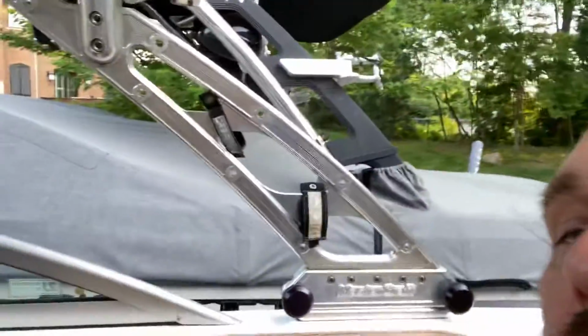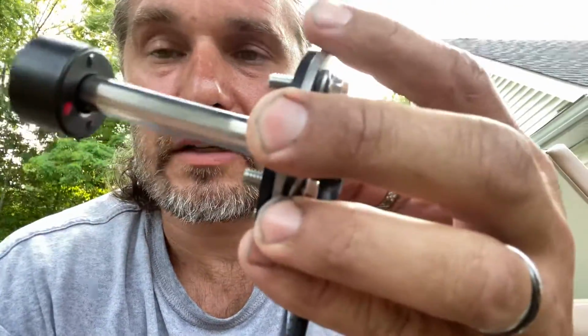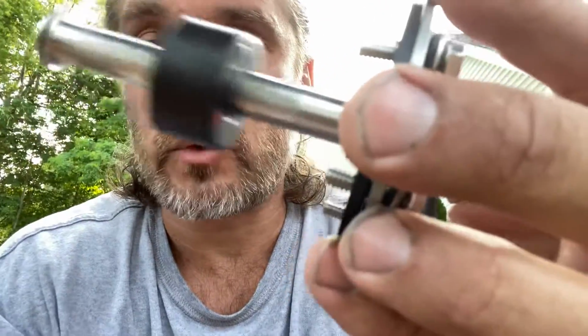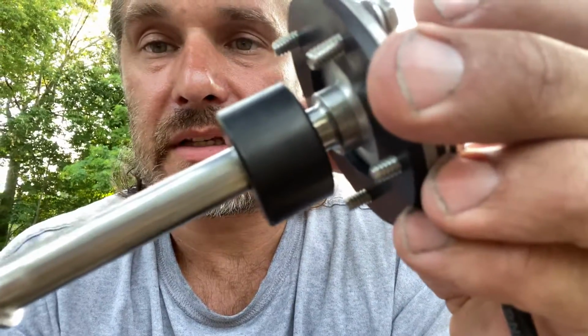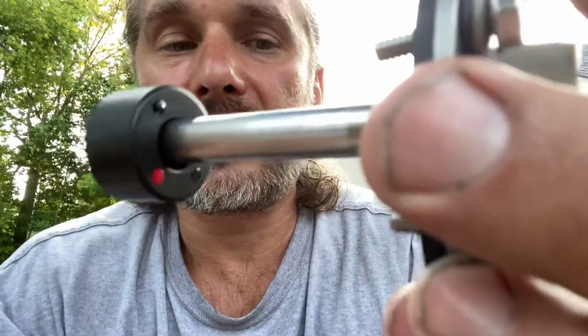Lately, I've been trying to get the boat ready to sell. I've got a different boat over here, a Malibu Wakesetter. Pretty much the same thing, but just a little bit newer. I like that better. And I found a guy who was fixing his fuel gauge. Basically you measure the same distance that you have on your old fuel or water sending units, in my case water. This has a little resistance slide that goes up and down. At the top it's 250 ohms, at the bottom it's like 33 ohms or 0 ohms, and it sends a resistance signal back to your gauges so it knows if it's full or empty.